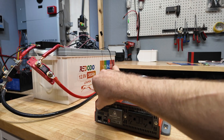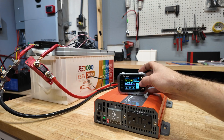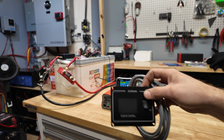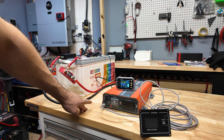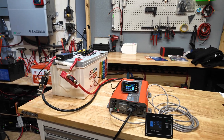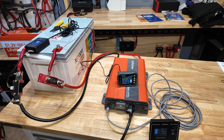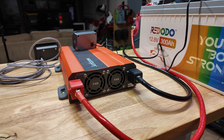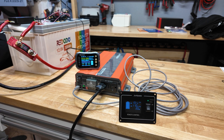With the inverter off we're using no watts. Turning it on, the idle consumption is seven watts — that's amazing. Now I'm plugging in the remote panel, which can display wattage so we can compare it to our meter. In remote mode you flip the switch to the second position and the panel switch controls the inverter. The first test: a 500 to 800 watt load to see how the fans react — will they PWM or just switch fully on and off?